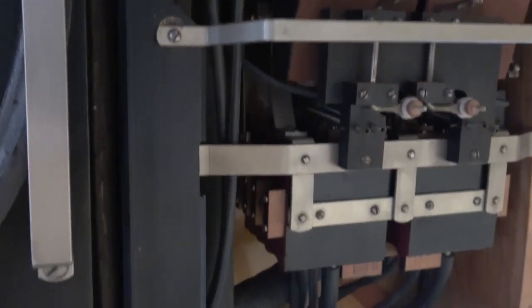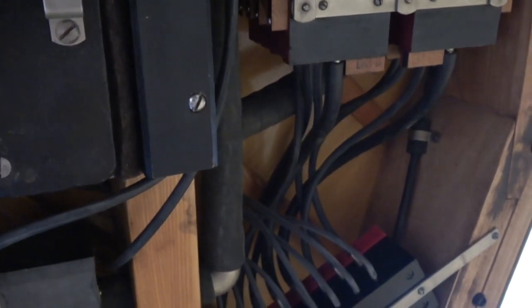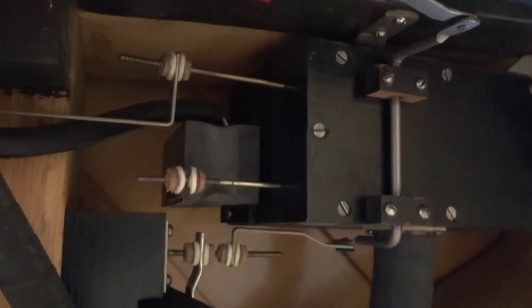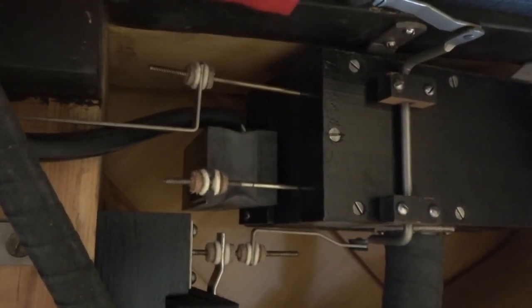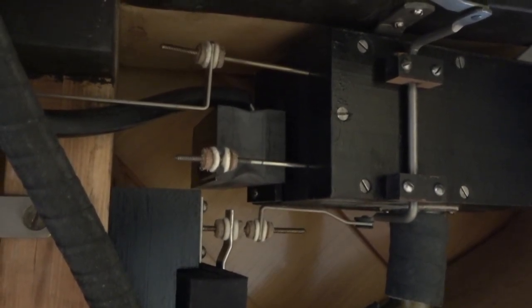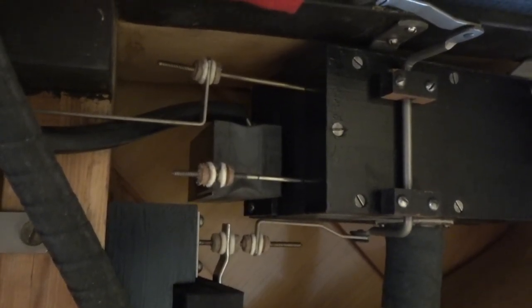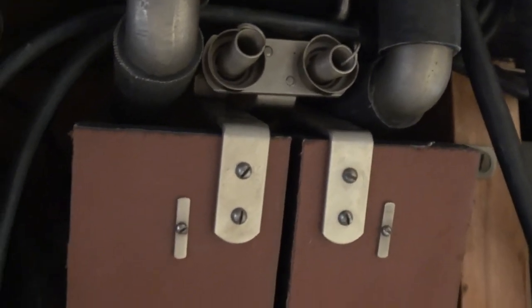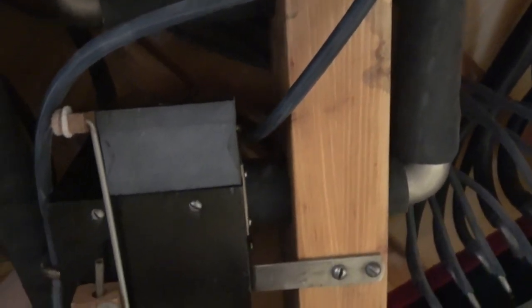And then there's some, let's say, air motor governor over there, that box over there that basically keeps the air motor going at a constant speed independently of how much vacuum there is in the system, so you don't change tempo if there's more vacuum. It doesn't speed up or slow down. And this is a regulator that regulates the pressure for the vacuum and not the whole system.